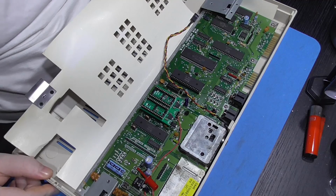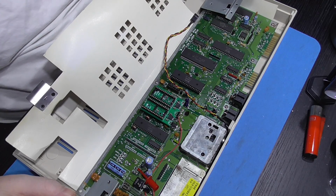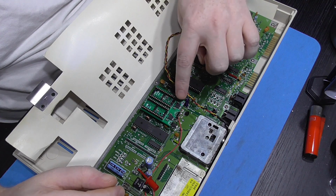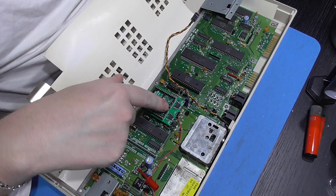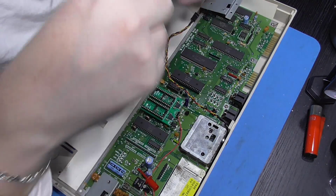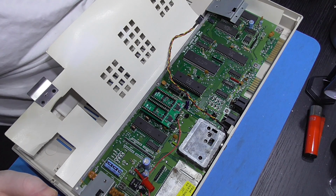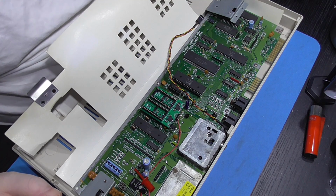What I need to do now is power this thing on and check pin 28 of each socket, because each SID has different voltage. The 8580 has 9 volts, and the 6581 uses 12 volts. It says in the guide as well. What I'll do is I'll link the guide and where you can buy one of these in the description on my YouTube channel. So I need to do that next. It says to do it in the guide as well, just to make sure, because these SIDs are getting pretty expensive now. I already had that one, it was already in, but this one cost me 25 quid. The last thing I want to do is blow the arse out of them.